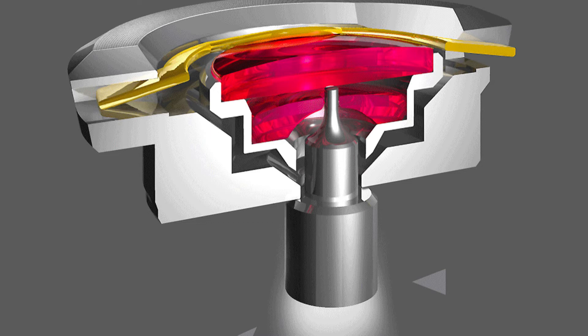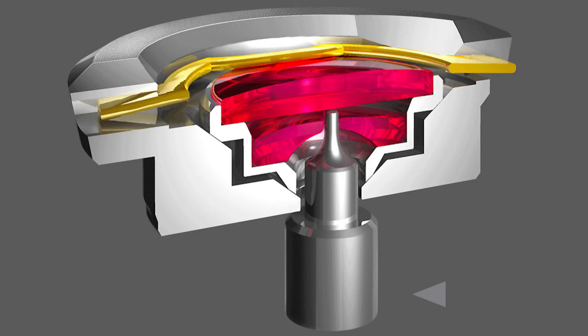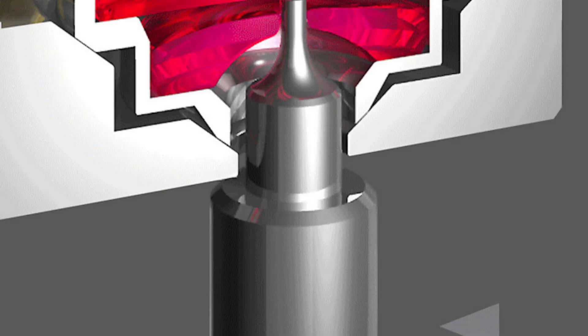The genius lies in how it takes advantage of the post's anatomy. The delicate tip of the post passes through the mobile bushing jewel, which fits snugly around it. However, closer to the balance wheel, the post becomes much thicker and therefore less prone to breaking. This part of the post passes through a larger hole in the end piece and the mobile bushing. However, the post gets even wider beneath this section — this stops the vertical motion of the balance wheel, sparing the delicate end of the post.